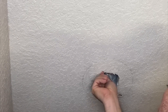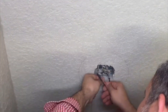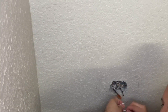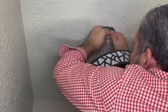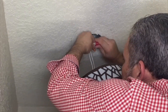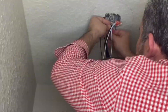Now let's go ahead and install it. It will be held with these screws that we have set up here, and then we will proceed with the connection of the cables. Here is how the lamp is held — now let's connect the cables. There are two whites and two blacks, and we start connecting them with each other. Once everything is set up correctly, paired up, we push the cables to the ceiling so we can install the lamp without the cables being exposed.